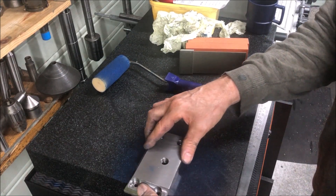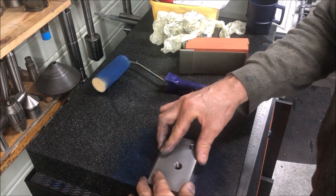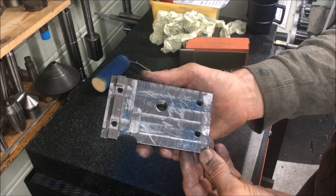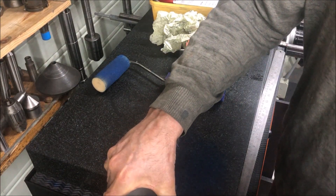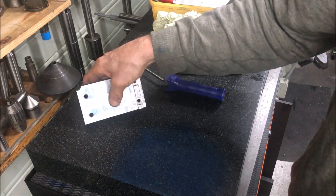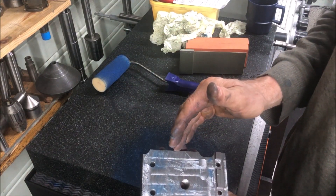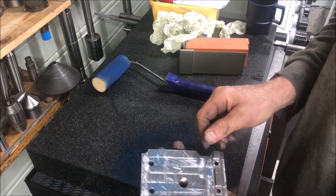Since I have this edge here I can't go straight, but I can do it like this. It feels kind of flat — oh yeah, definitely gets better. I'm not far off really. So this edge also I need to test it in situ, because you can get any kind of result here. So not really anything different than cast iron, apart from the fact that you need five or more degrees of positive rake on the blade, and lighter strokes as well.